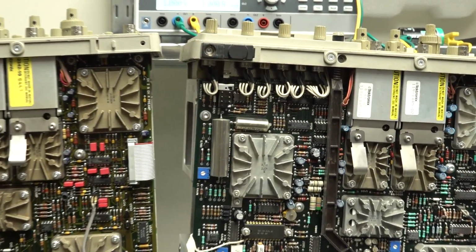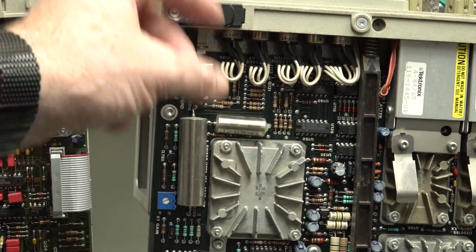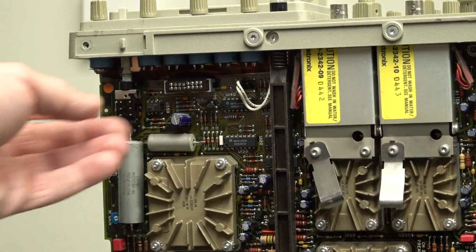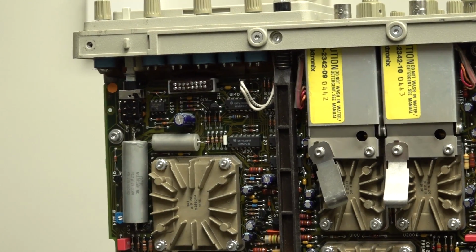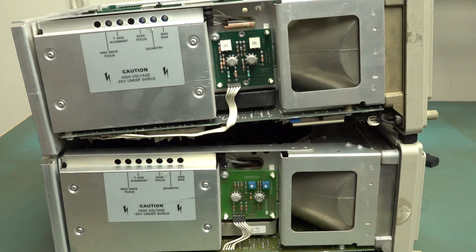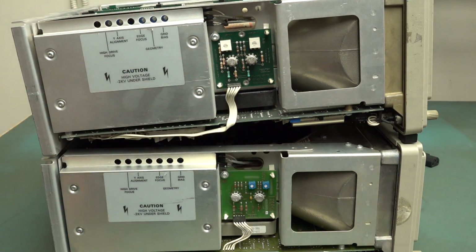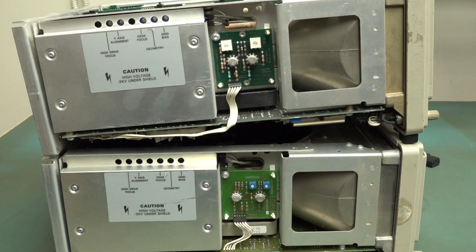Sorry. You can see small little changes, like these have discrete wiring just going to headers from the controls, the knobbies on the front, whereas this one over here, the newer model, looks like it has flat flex on there. So just some tidy up improvements in terms of manufacturability. And from the side, near identical as well. The board has changed, but the functionality hasn't. I'm sure the wiring's even all the same. So they've just changed the pots over, but it looks similar.